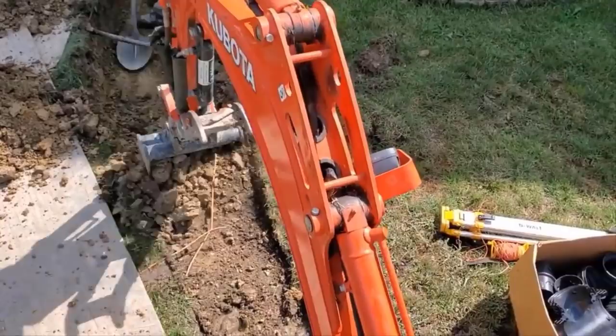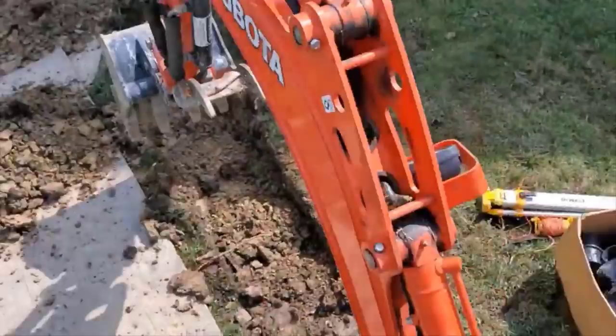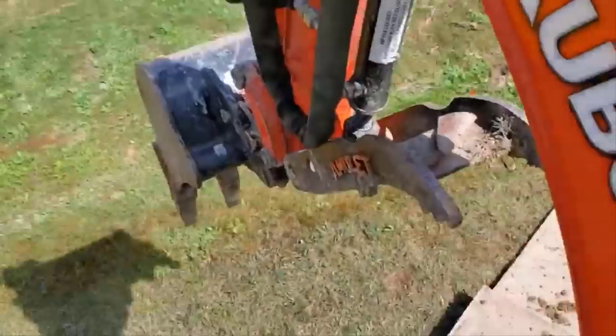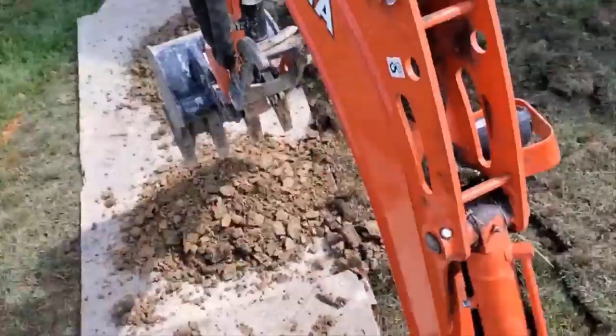This is the only way to handle these situations where you're at the bottom of a hill. The water comes so fast and there's so much of it. If you can't contain it in a large yard drain system, and in this case, start to disperse and lose some of that water in the front yard in a leach field, it's going to fall behind and the water is going to find its way into that walkout. This is a walkout, so you know there's zero tolerance when you have a walkout. You've got to get all the water as soon as it comes in.